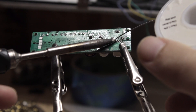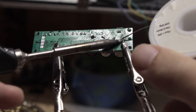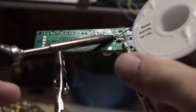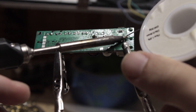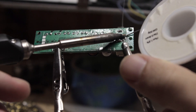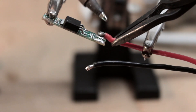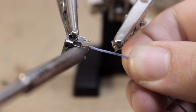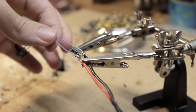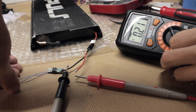First things first, like I mentioned earlier, I had to desolder the original USB port, push button, and connection to the battery. Is this what you guys really want to see? You want to see ASMR soldering content? You want me to talk really slow and quietly? If you're as creeped out as I am right now, drop me a like on the video. With all of those removed, we can go ahead and wire up the battery connector to the soft latch, then add some wires to the push button and attach it as the trigger for the soft latch. With those two pieces together, I gave the soft latch a quick test with my multimeter. It all seemed to work alright.